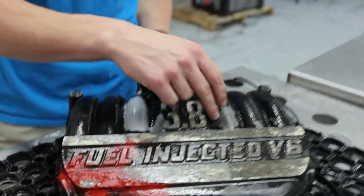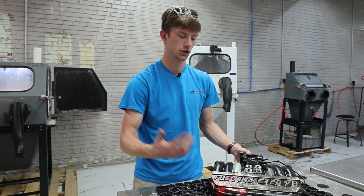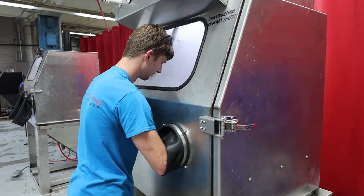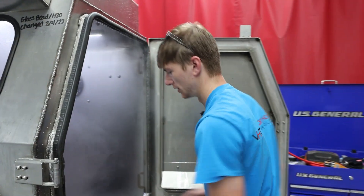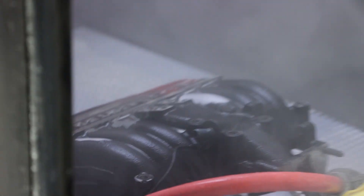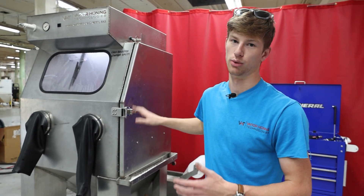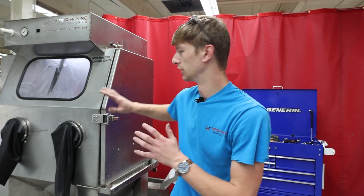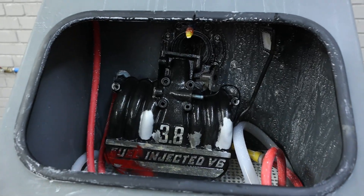I'm going to try the ceramic and glass bead sections next. If they don't take the paint off, I'll put them back in the crushed glass to strip it quickly and then finish with those abrasives to show you the result. Looking at the glass bead section — it is actually taking the paint off, but it's very slow. I want to mention: a lot of people think your ability to remove paint or rust comes from air pressure — it does not. It is predominantly determined by your abrasive choice. Air pressure does have an effect, but abrasive choice is the primary factor. Give us a call or leave a comment if you have questions.